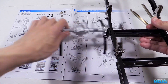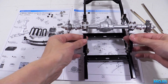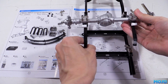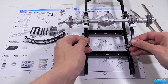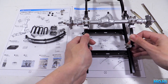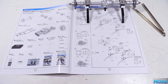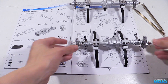What we do is fit the leaves into the mounts on the chassis, adjusting the position of the mount so the axle sits nicely, and that the axle angle has the drive input pointing straight forward. When they're all spot on, we can go around the nuts and tighten them up so the axle is firmly clamped. It's important that everything is positioned nicely, or the suspension will bind up and probably cause premature wear. The front axle goes together in exactly the same way, except rather than level, the drive input should be at a 5 degree angle. There is a nice clear diagram, so you have to really work at it to get it wrong.